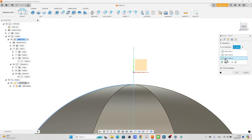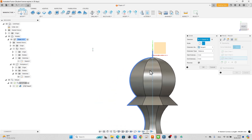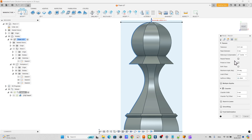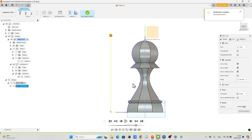Now we can continue to select the last curve. Go to Passes and click Preserve Order to make the toolpath move in the order of our click selection. Next, we will simulate the toolpath to see how the cutting tool will move.